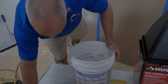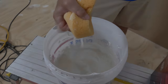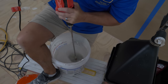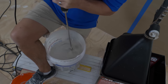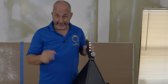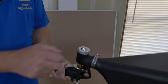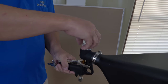We've still got half a pail. I'm going to use my sponge here and add a sponge of water — that's what we're using for flowability. Just enough to really wet it up. Now I've got flowability — that's moving around real good. I'm also thinking my nozzle might need to be changed because when the mud was there it really blew it out and I'm looking for a little bit more control. I'm going to switch it down to the medium size. Make sure the gasket is in place too — it'll pop off sometimes.